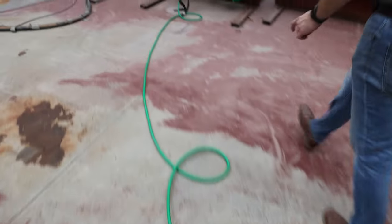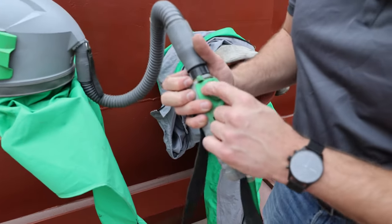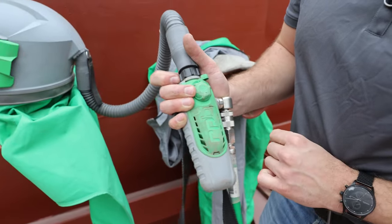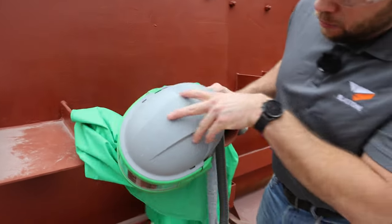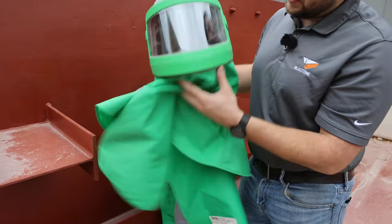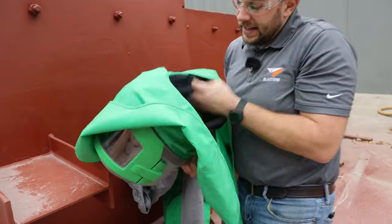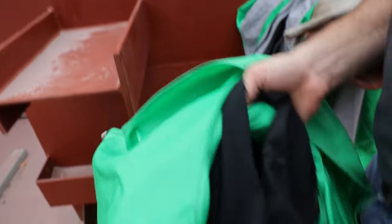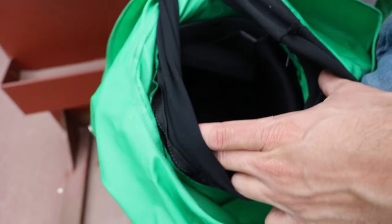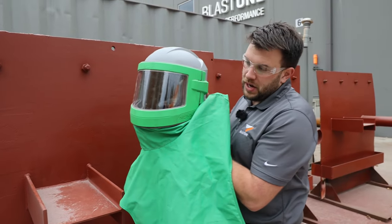If you follow the breathing air hose, we go to our blast helmet. From here we have what we call a C-40, which allows you to have either cold or hot air into the helmet and a dial which regulates how much air goes into the helmet. From there the air goes to the back side of the helmet, as you can see here, and into the screen so that you never fog up and you have fresh supplied air while blasting. There's an outside cape to keep the abrasive off and an inside cape for comfort, with pads inside the helmet like a motorcycle helmet. This allows for comfort and the helmet itself moves with your head when you turn — the older versions would stay put and you'd see the side of the helmet, whereas the Nova 3 actually turns with your head.